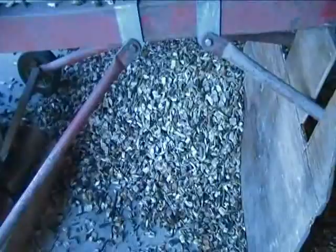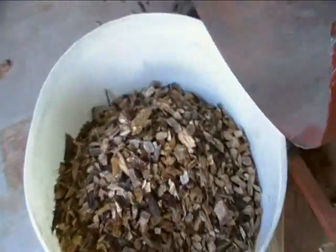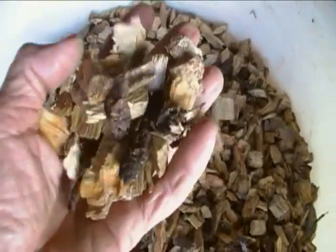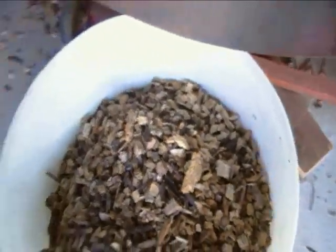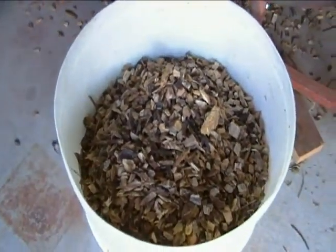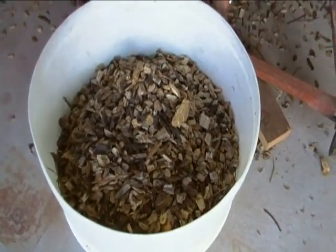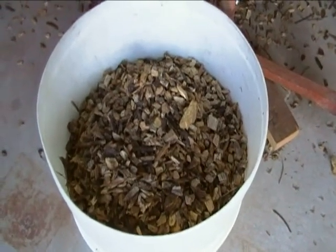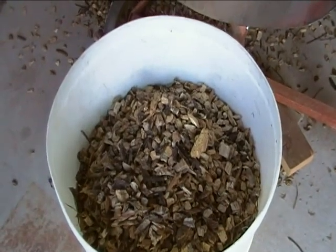The second screen gets the keepers. This screen is half by one inch, and anything that falls through there I consider the keepers. The oversized material is this size stuff — at least that's what I'm calling too big for right now. I may try to run some of this in my gasifier after checking it for excessive twig lengths. The issue is I don't want the chip so big that I don't get enough pressure drop across the fuel pile.